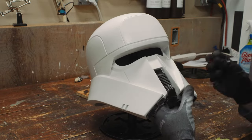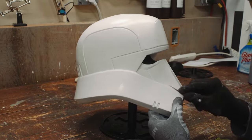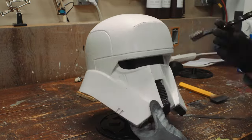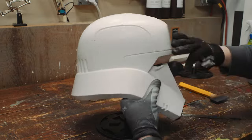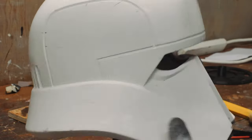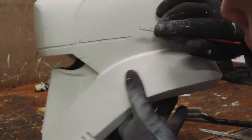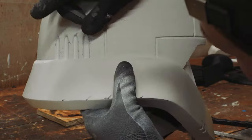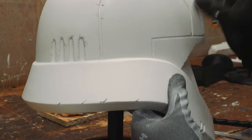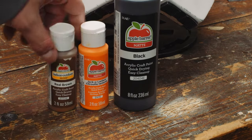It's strangely cathartic. There's an initial panic as I come to grips with the fact that I'm going to be thrashing this thing, but then I kind of just let myself get deeper and deeper into this slow organic process of chipping here, chipping there, scraping this, scraping that — making sure that nothing is ever symmetrical, making sure that any high point that could be knocked is knocked or dinged in some shape or form. I used a file and a wire brush and just slowly over the course of an hour or two knocked back every sharp angle and any high point that I felt needed to be not so clean.